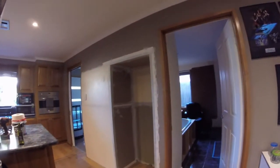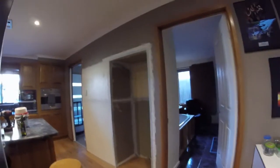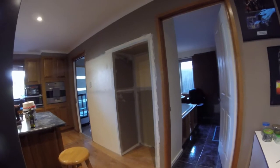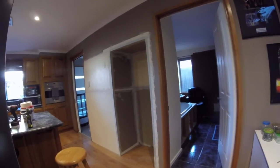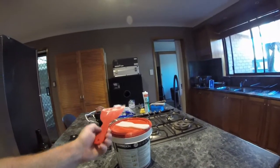I've got a first coat on everything. According to the instructions, I'm supposed to let it sit 24 hours. It's been quite a long time since I've done any major plastering - products have changed over time. So we'll leave it 24 hours, let it all settle, let all the really deep cracks and crevices go hard. Then we'll come back and use a wider spatula - started off with just the white one to fill in, just getting to the corners, then we can step it up, go a bit wider. It's just a really rough once-over, just to sort of bed everything in, and tomorrow we'll have another crack at it.